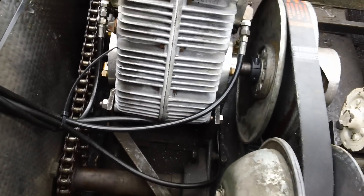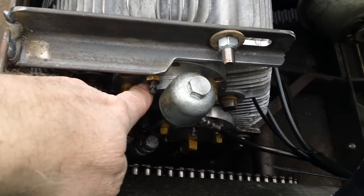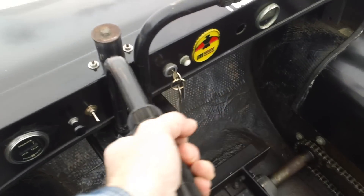This gives a better idea of what you have: basically hydraulic cylinders up in the steering that go to clutch packs which engage the top and bottom. The upper clutch pack is for forward drive, and there is a lower clutch pack that works the reverse drive. The hydraulic cylinders are up in the steering — it's in a neutral position now, but they will lock into forward or you can pull them back for reverse.